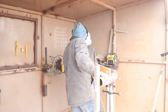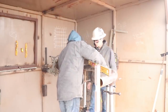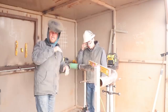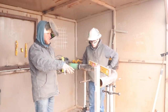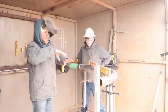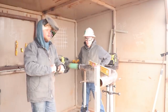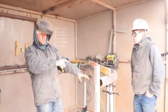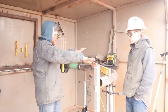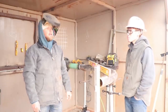Part of fitting this up is looking right here to see what your gap is doing — you're going to have to start moving and kicking things around until side to side everything's about right, and then we start leveling. One thing about these sweeps is they're kind of a pain because you've got so many jack stands involved. Right now we've got three jacks. The middle jack controls a lot to do with the outside face level, and then this outside jack really determines the center.